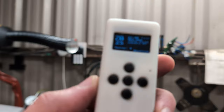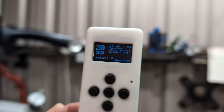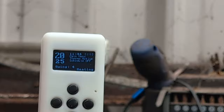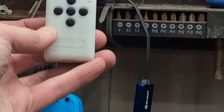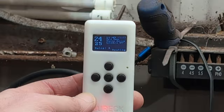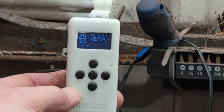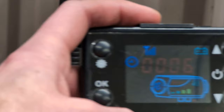On/off button on the side. The heater is currently running. What I'm going to do now is put this thermostat in the hot air coming out of the heater so the temperature goes up, and it'll show us switching to the off position once it gets warm enough. My hand's in the hot air — I need this to be in the hot air. I've set it to 25, so it turns off at 25. The swing is four degrees below that. That's the heater now gone off — heater is off.